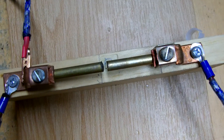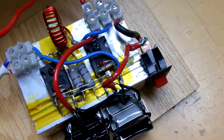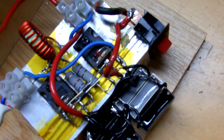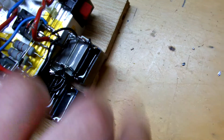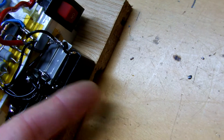Here's the safety gap. Normally I wouldn't push a ZVS driver that hard with resistors so small, but those actually don't get too hot. The main thing that I find warming up are these capacitors here — this one is actually beginning to swell and it's quite hot to the touch.